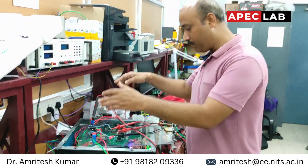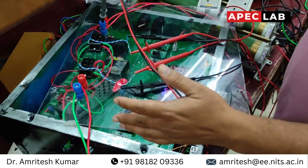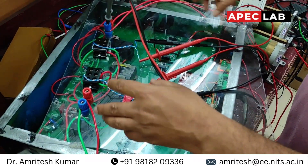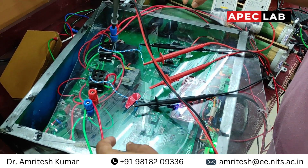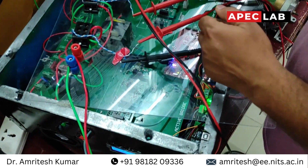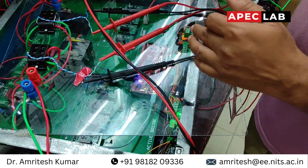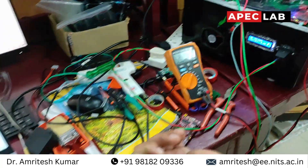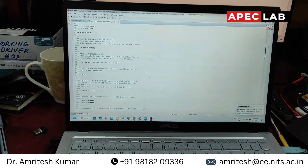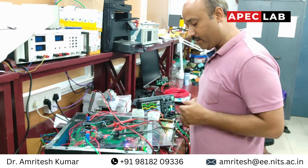As you can see from the top, we have two sections — one for each H-bridge. We have a plug-and-play driver board, and this is being controlled through a TI-based microcontroller. We have programmed this TI-based microcontroller using the CCS Code Composer Studio platform, and the gate pulses are being generated from it.